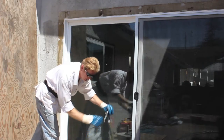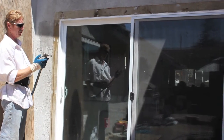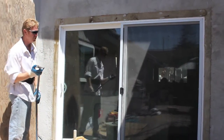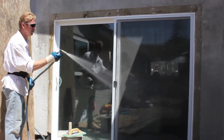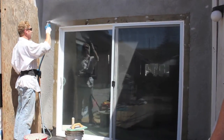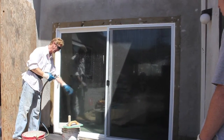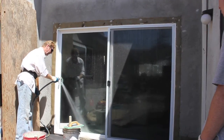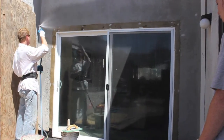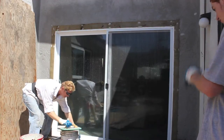I'm going to take a water hose because it's about 90 degrees already and the sun's coming. The walls are hot — it's going to draw the water and moisture right out of this color coat. So first I'm going to saturate this wall. It doesn't matter if I get this window wet; it's a deck. If I drop any on the track, I'll just hose it in. The idea is to saturate this so when I do my coat right now, it will adhere.